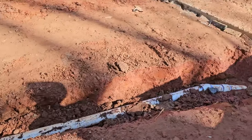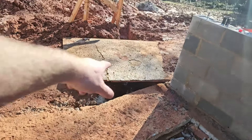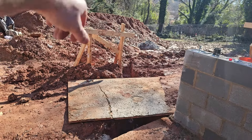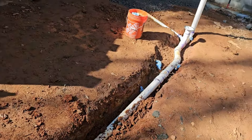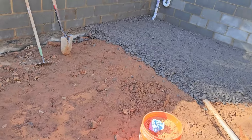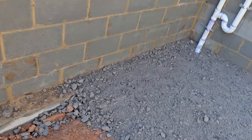The good thing here is the direction that we're going — heading out that direction, the actual sewer line comes down through over that way. So we are able to actually go downhill without having to do a sump pump, which a lot of times you have to do for any kind of bathroom or sewage that you have in a basement. But in this case, we're actually uphill from it, so we're good with that.